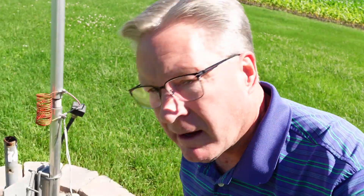Putting it together — construction is very straightforward, very easy. Tuning it up for 40 meters: moving this coil, stretching the coil or bringing it down a little bit to get the SWR easy, then compressing or pulling this coil — really easy. I think it's about $650 for the antenna. It lasts a long time. I like working DX, and I also like working contests — whether it's domestic like Sweepstakes or international DX contests. This thing puts out a killer signal in all directions.